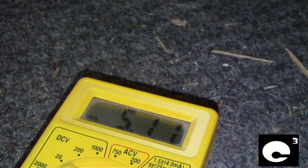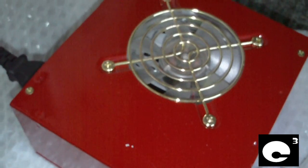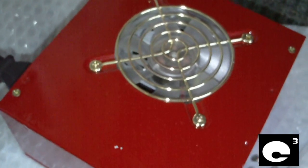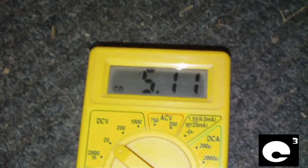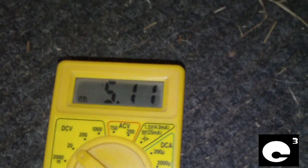It's staying right there — 5.11, 5.12, it just really depends. This power supply I've talked a lot of good about. It's built very well; it's only a $25 power supply from Newegg. The only issue with it is it comes with poor capacitors from JEE. After replacing the capacitors, this power supply is doing very well. This is the second one I've recapped — the other one's in the Blankmax. We're still getting a solid 5.11 volts.